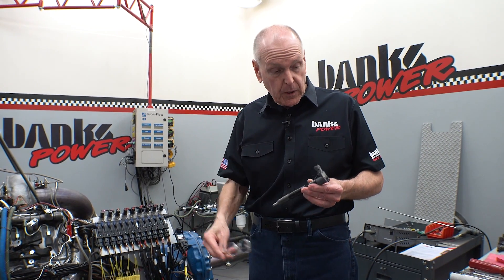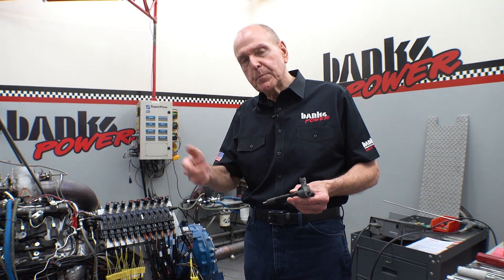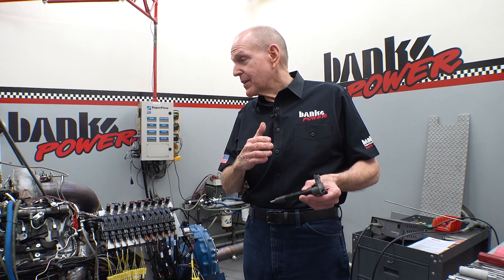Why do I want to go to 3800 rpm? We're at 230 bar cylinder pressure now. The engine's design limit is around 183 bar. I don't know how far I can go before I pop the heads off or kill something else — we're at 230 bar at 711 horsepower at 3300 rpm. If I go faster, I'm doing more cylinder firings per minute and can make the same horsepower with less cylinder pressure. If I stay at 230 bar and go out to 3800 rpm, I'm a little edgy about structural integrity, but I think we might actually do that with less than 230 bar.